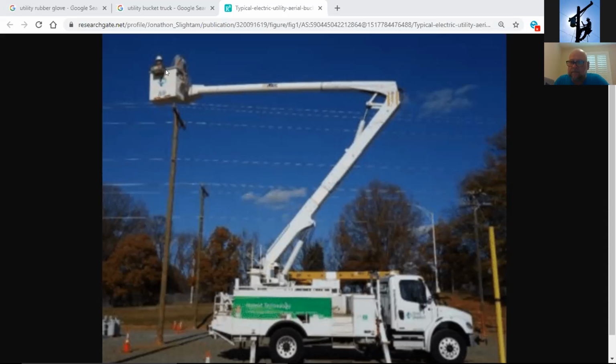You also have 100 kV per foot through the bucket, and this small section right now, we would say, Professor P, about 3 feet. Yeah. So you're looking at potentially about 2 million volts worth of insulation between yourself, if you make contact with the conductor, and the ground. Guess what the bucket truck operator manual is going to say about working out of the bucket? Since I have 2 million volts worth of insulation, am I now able to touch a live conductor without any protection on?